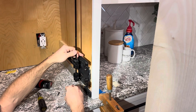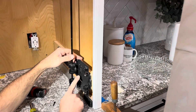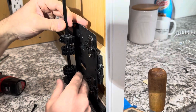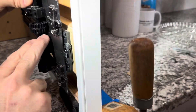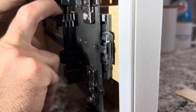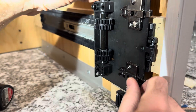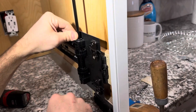This is the rod that's not connected — there are four screws, they look like an 8-32 pan head screw. You can see the machine holes in there. This is a D-shaped rod, so it has a flat spot on the back and is rounded on the other sides. The cogs float up on the rod. You want to get down to eye level and make sure the cog fits between those two grooves in the plastic rail. Also important — you need to make sure they're both locked out in the front so they're not off, then you can start putting the screws in.